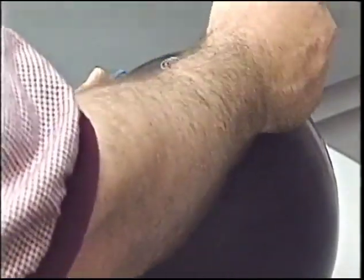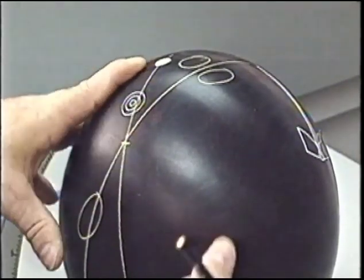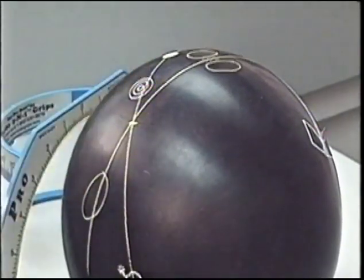Placing the thumb hole below, finger holes above. The pin will be in the track to the left of the middle finger. The bomb will be in the track to the right of the thumb hole. This is a full roller high RG drilling.